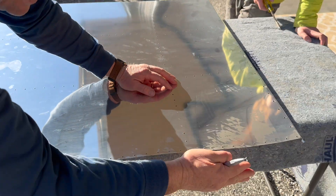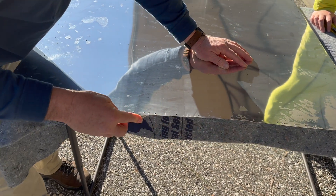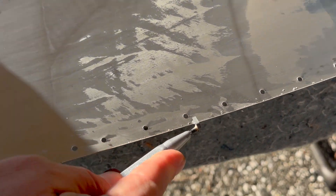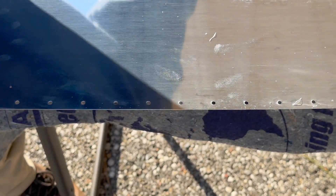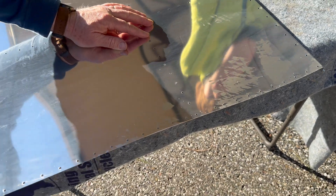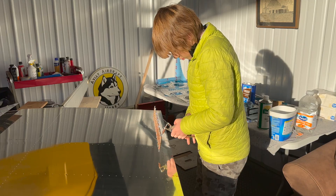When they stamp these things out, they leave pretty rough edges. If you don't treat the edges, they'll potentially crack on you at worst, or at best it'll cut you. Hear that tick tick tick? That's from the stamping operation. You kind of go until that stops — well, you might take a little too much, so you're just trying to knock them down a little bit.